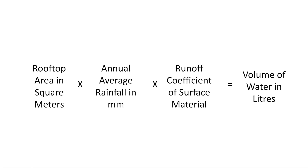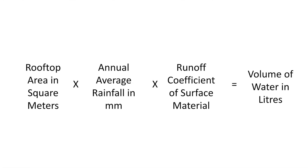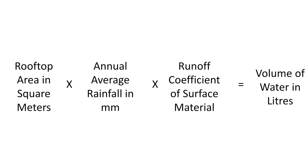This is a very important thing for all of you to consider, given that we are headed towards times where water is going to be scarce. Our dependence on municipality water and borewell water is too much, and we must build some self-reliance in terms of our water needs. Why don't you calculate the surface area of your roof multiplied by your average annual rainfall in millimeters, then multiply by a runoff coefficient — safely assume anything between 0.8 and 0.9 — and tell me how much rainwater you get on your rooftops every year. Leave that number in the comments below, and also share what you think you could do to start harvesting this water for personal use or to irrigate your garden.